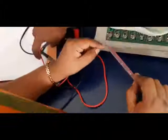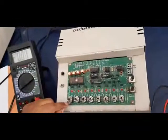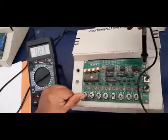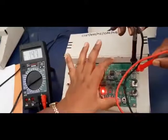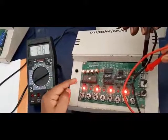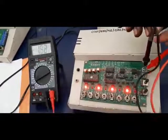Since I have considered the 8 switches in the 0 position, that is the 0 position is the downward position. In the kit itself it is marked as low in the downward direction and high in the upward direction. Now I am going to vary the position of the switches so that when it is brought to the 1 position, the corresponding LEDs will be glowing in the kit. So the high position is the upward position of the switch, and the corresponding LEDs in that position will glow.